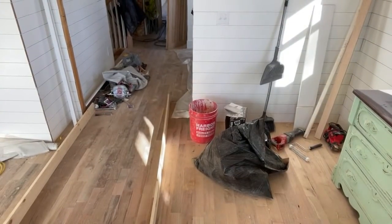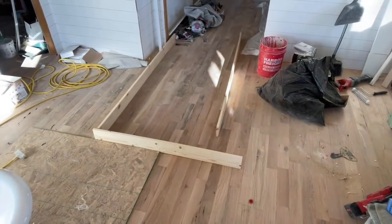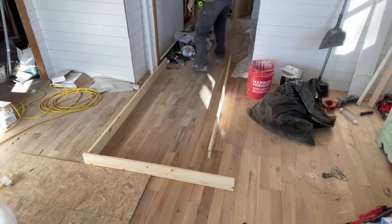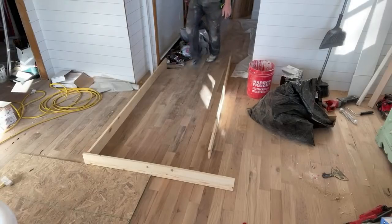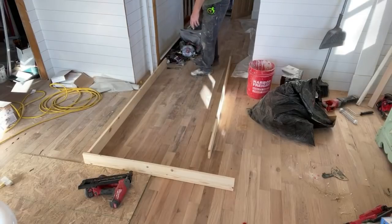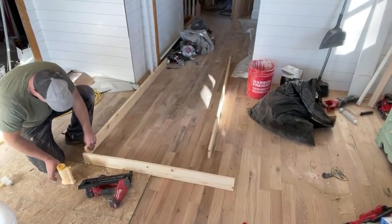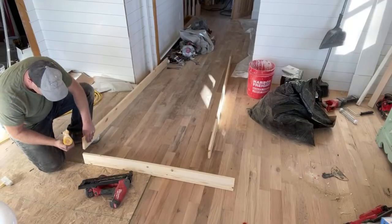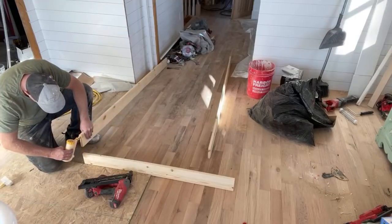We're in the master bedroom — it's slowly becoming more clean. I've got a 15-gauge nailer I'm going to be using. I used to screw these together, but once you shim the wall and screw to the wall that part doesn't really move. I noticed all the door jambs are nailed together, so I've been gluing and nailing them — it's much easier and you get less split-out with the wood. The 15-gauge nailer shoots a much larger nail and I'm running two-and-a-half-inch nails, so they drive down nice and deep.